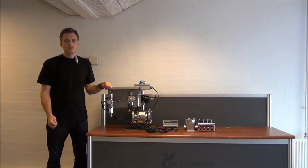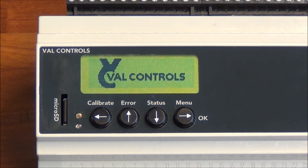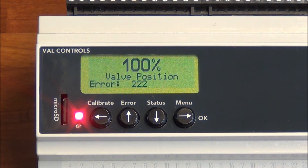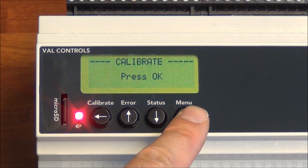The system is now set up. Let's go to the calibration. I will now power up the system and show you how easy and simple it is to configure and calibrate the unit. The only thing you have to do is to press calibrate and do an automatic calibration. During the automatic calibration the unit will perform a partial stroke and a full stroke, and the valve signatures will be stored on the SD card. To start, press calibrate, then automatic, then ok, and ok one more time.